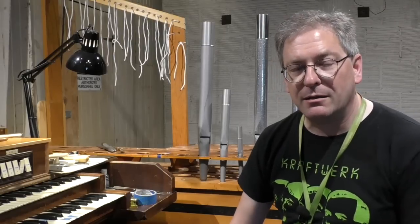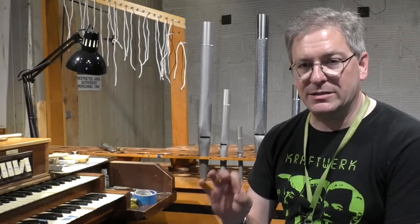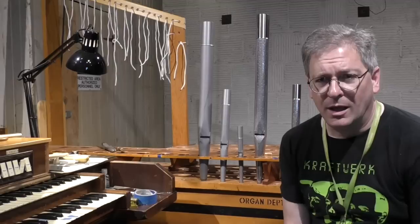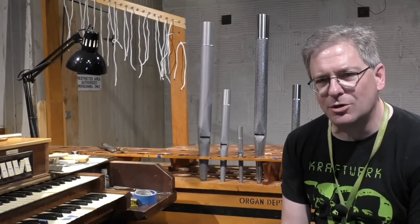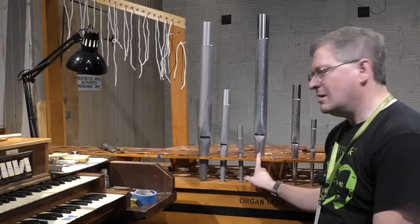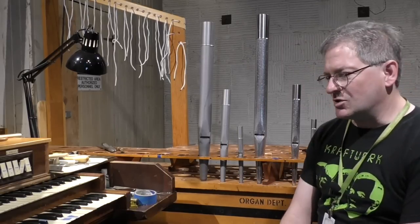All right, I'm going to go back and raise the VFD up to 8 inches. So we'll be on fully double the wind pressure it was designed for, and let's see what happens. Okay, the wind pressure has now been fully doubled to 8 inches of wind, and there's a kind of a strange pattern emerging that these two pipes, the 2-foot Cs, are both having trouble where the upper pipes are working just fine.